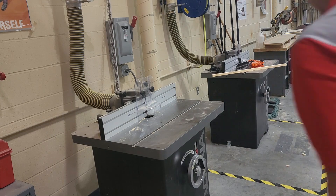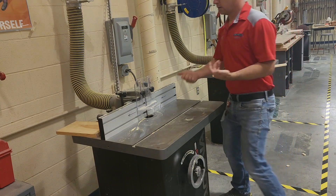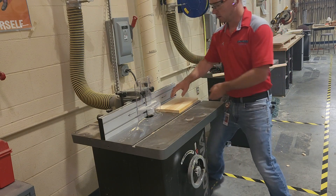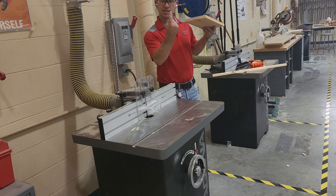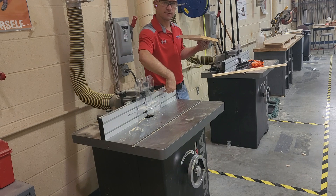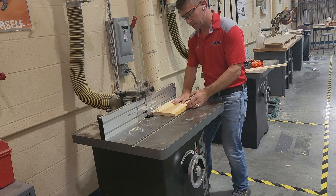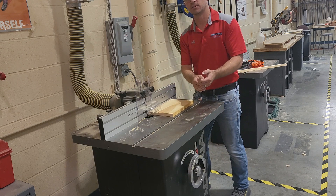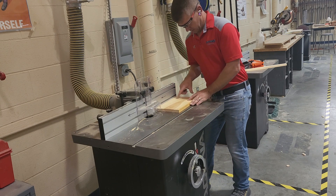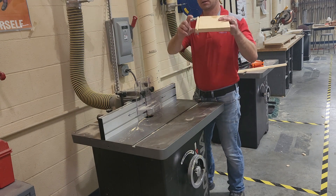So the router operation: we turn it on, it starts spinning. When I had my board, I had pressure in a couple of directions — pushing against the fence to keep it there. The router bit itself is going to try and keep the bit there; it's spinning this way, so when the router bit catches on the material it naturally pulls it towards the fence. Something that scares beginners: if they don't have the board against the fence and touch the router bit, it yanks the board and pops it against the fence.